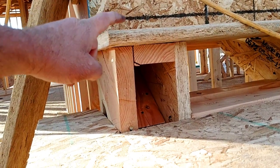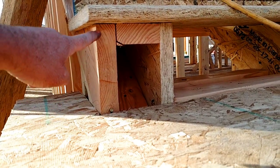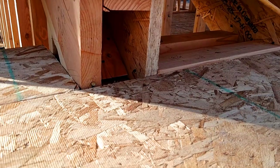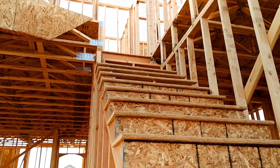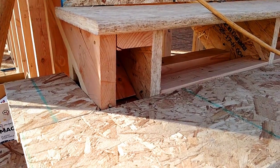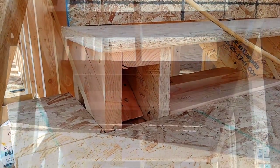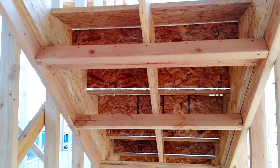At the bottom, the adjustment is reversed. The last three steps are all 3/4-inch material. To get the distance from the top of one step to the top of the next to be exactly 7 and 5/16 inches, you have to subtract that 3/8 of an inch — so the measurement from here to there is 3/8 of an inch less than 7 and 5/16. At the top you add 3/8, at the bottom you subtract 3/8, to compensate for the different material thickness. If you don't do that, you'll feel the inconsistency every single time you walk up and down.